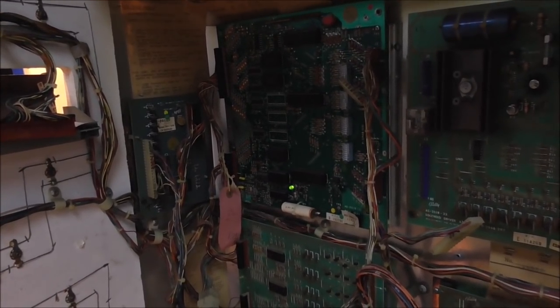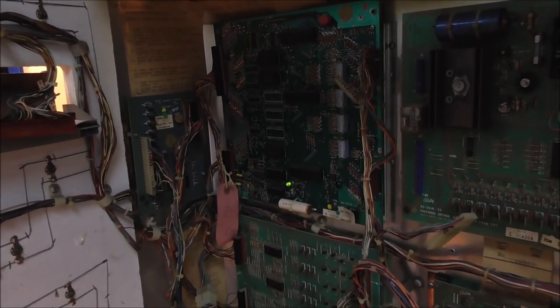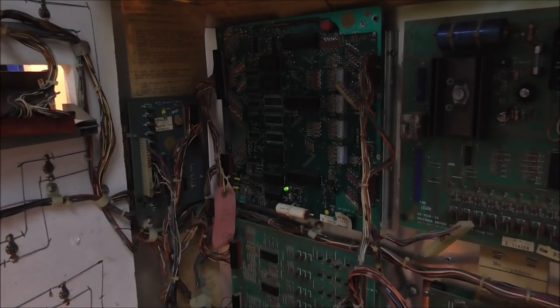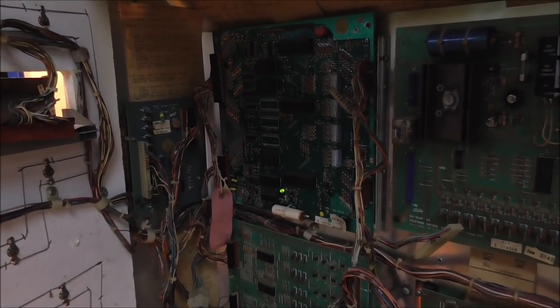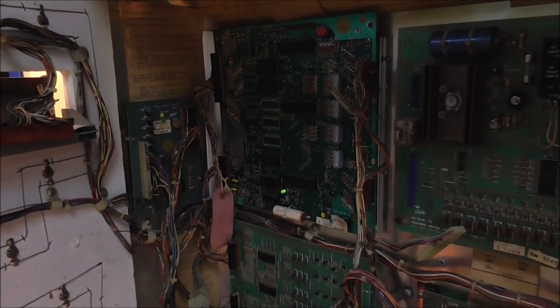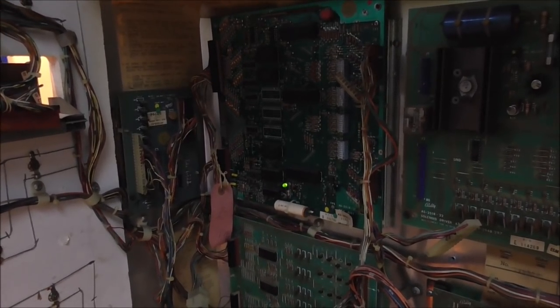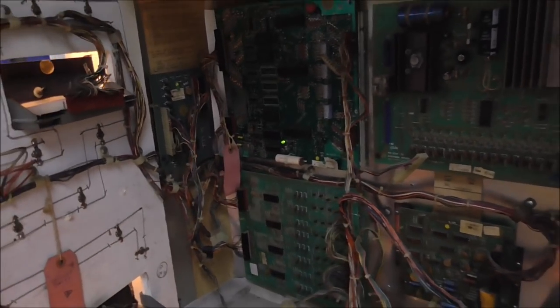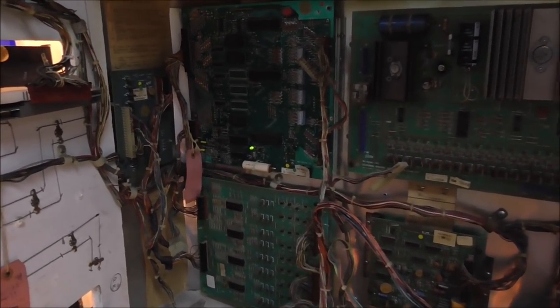You can rig up a bench rig for this if you want. If you look in the schematics, all you need to send the board is ground, 12 and 5 volts on the appropriate pins of that connector. There is a solenoid voltage that you need for the final flash.